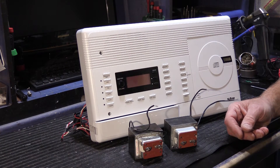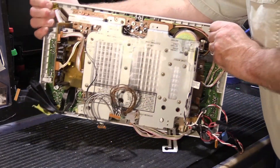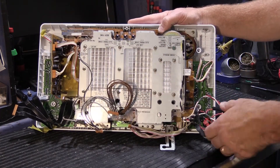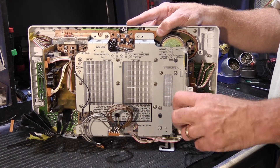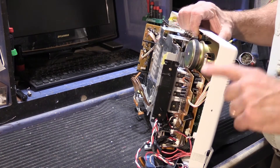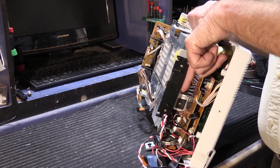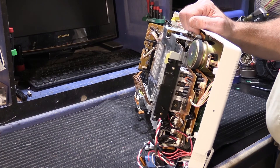So you need a different and easier way to figure it out before you put your repaired transformers back in. And there's actually a fairly easy way to do this. So let's take a look at our 4406. On the back, you have this big assembly with the large finned aluminum heat sink. Down here, the red and white wires are the wires that get connected to the transformers — the power wires. These feed the primary power supply, which is in this section of the power module. If there's going to be a fault that will overload the transformers and blow the fuse, it is most likely going to be somewhere on this board in this area. I'm going to show you how you can check the likelihood of a failed power supply before you connect it to your newly repaired transformers.